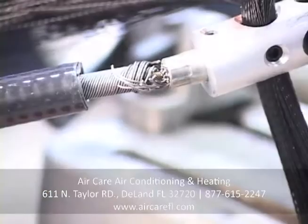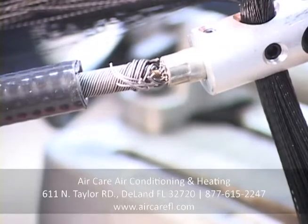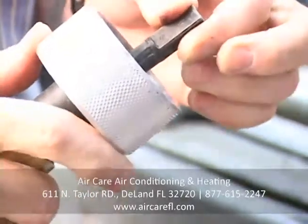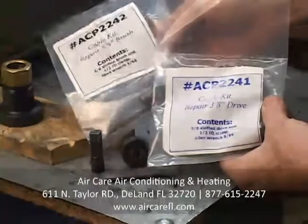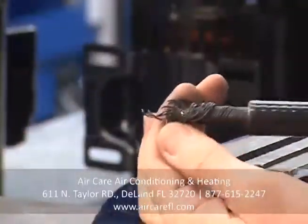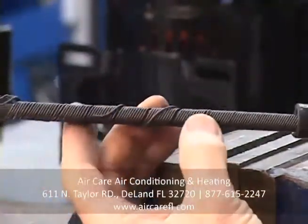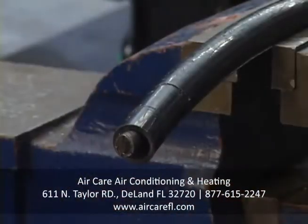Even the most rugged, flexible cable can break. The most stress and strain is at the brush end and, to a lesser degree, the machine end of the flexible drive cable. Air Care has cable repair kits to return the cable to service quickly with a minimum amount of work. Once a cable has failed, it's important to cut off all of the damaged wire strands before attaching the replacement end. The outer nylon jacket must also be cut back.